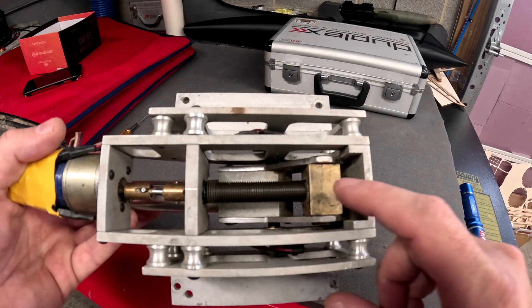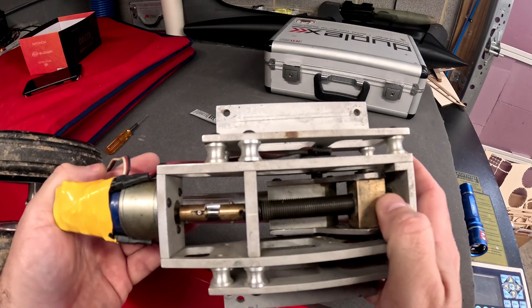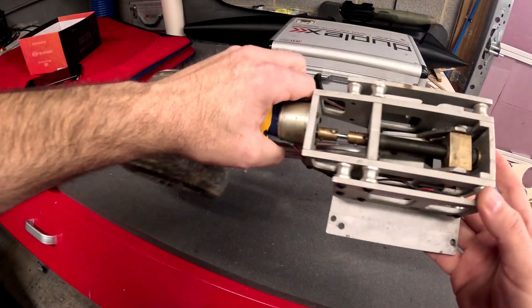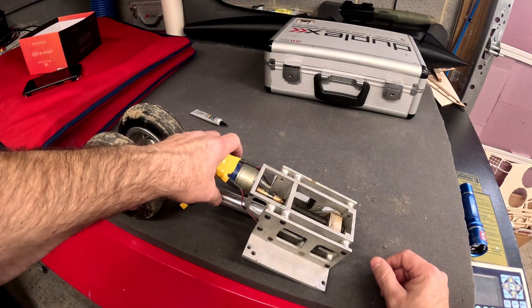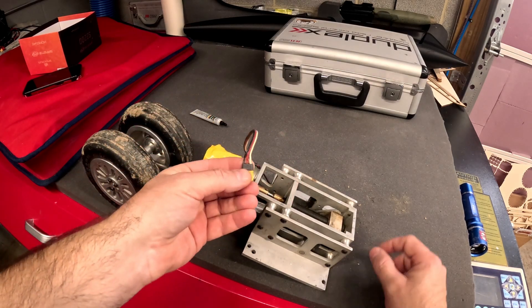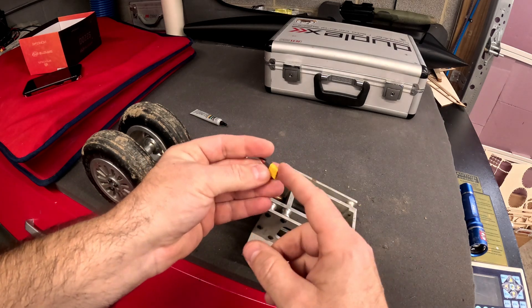It goes into a brass block with a couple of brass bushings on either end. The shaft itself has a little bit of play and just sits in there — they've turned off the threads and stick it out either end with a little nub for the brass coupler. It's a two-wire motor wired with three wires, so depending on how the current goes between those three wires it dictates if it goes forward or reverse rotation.